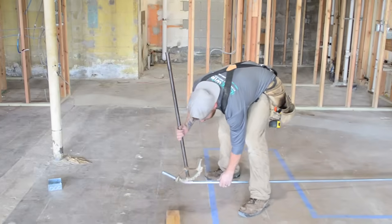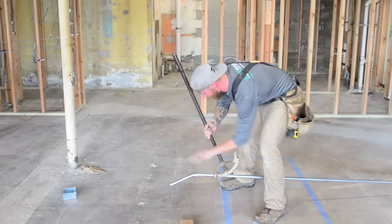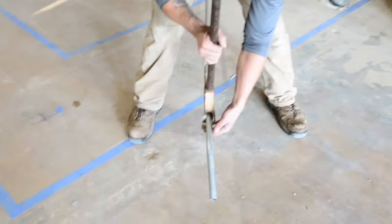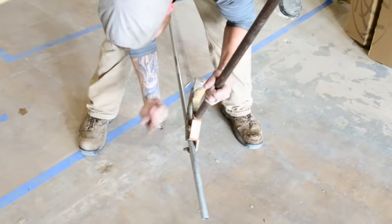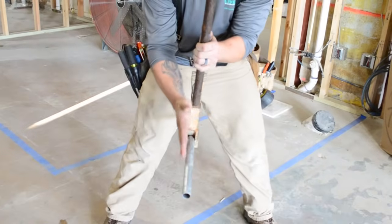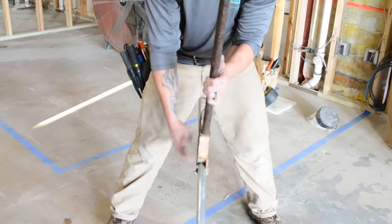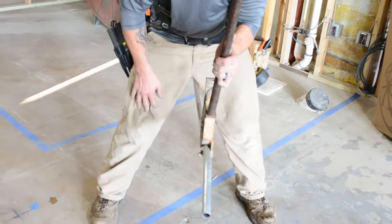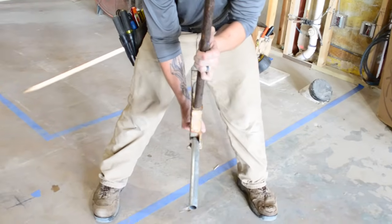Now, the second thing you're gonna do is keep your bender on the pipe, but twist it 180 degrees. So now that bend is going down. When you're bending on this second mark, you're gonna put your arrow on that mark again. And again, I can't see that mark now. That's the reason I draw the line all the way across, because now I have to look at this side of the pipe. But you can see that that's cocked, right? You wanna make sure that pipe is straight with your bender. Look at the bender and look at your pipe and see if they're both in a straight line. If it's off to the left, just twist it. That's why I lift it off the ground too, because it gives me the ability to really control that pipe. So line it up with your arrow.